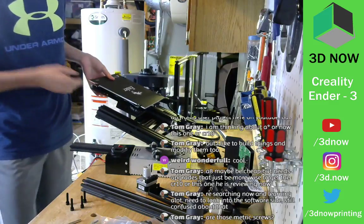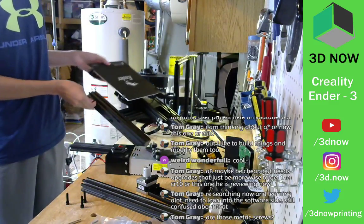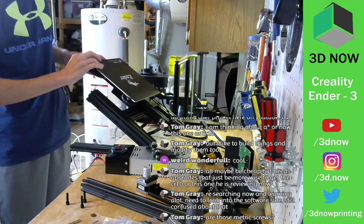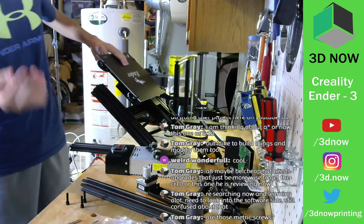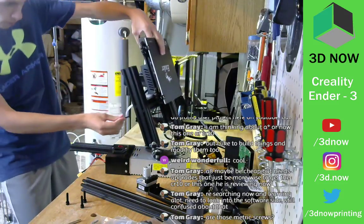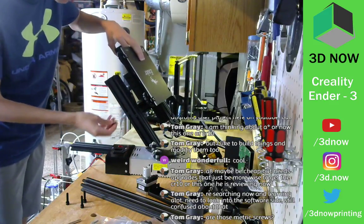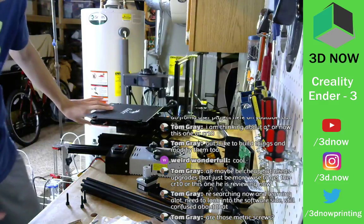And then the slicer has the profile for your printer, so the bed size, how many extruders, and then you can change in the slicer the nozzle temperature to match your filament. You can change the orientation of the model. You can change the infill, shells, everything about the model. I'm not doing this right at all.